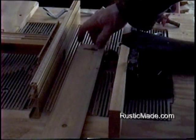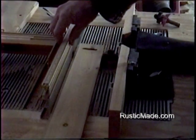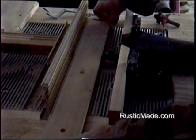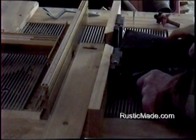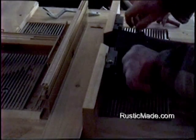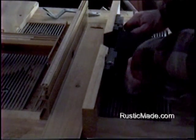I set it for the height of my groove, and I'm just going to adjust the backstop — that's what we're going to call that — and tighten that up so it slides through freely. Then I'll go ahead and tighten the front part up so that it doesn't jump around any, and then tighten those up.